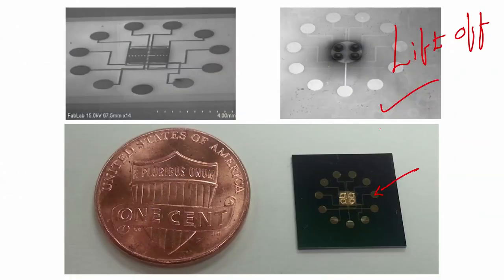If you see the chip, it will now look like the one shown in the figure. This chip consists of a gold electrode with SU8 pillars that are conductive. It is also integrated with a micro heater and a piezo-resistive material.